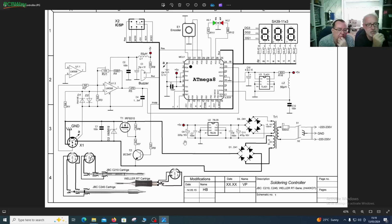The LM358 over here, U1, is connected to that. Yes, but you notice here this is connected via an inductor and then a capacitor to smooth it. No, it's on 5. That's plus 5 volts. That's this rail, this is supply. There's 2 supplies. There's 5 volts and there is 12 volts. Weird. But the 12 volts only supplies this circuit loop here. With D1 and D2, he cuts off the header there, and R3 and R4 with the RV1 makes a level there.